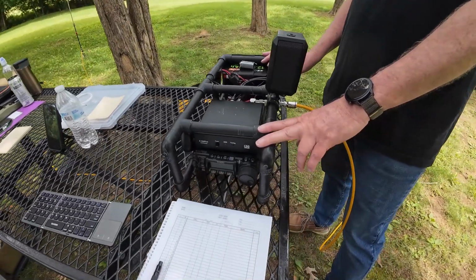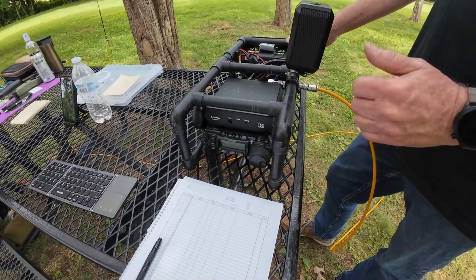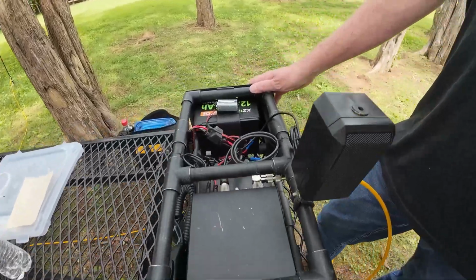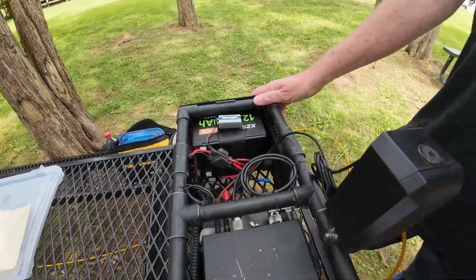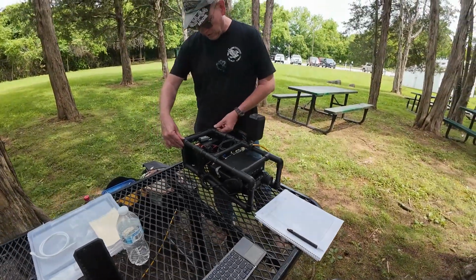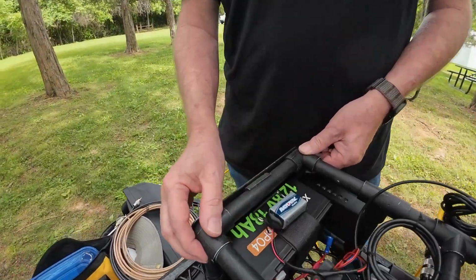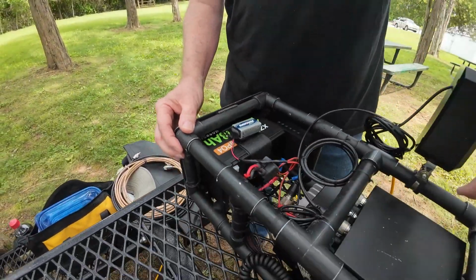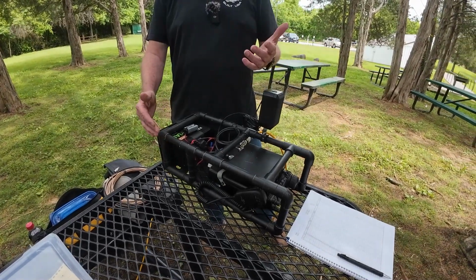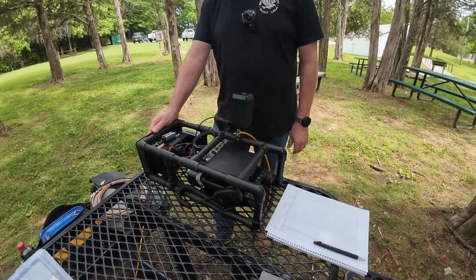So tell us about your go box. I was looking online and I saw the copper pipe packs that people were using. Well, I had an 857 and I wanted to be able to use my tuner, but I needed enough power and everything else. So I got the idea of using PVC. By using the PVC pipe, you have the three-way ones down at the back corner here with this aluminum support. By using those, it automatically squares up the tubing. With the copper tubing, you have to get some type of brace to keep it square while you're soldering. Right. And this glues together.